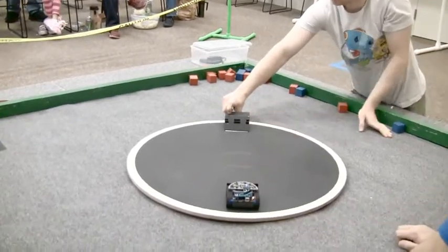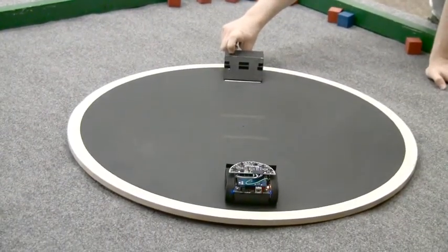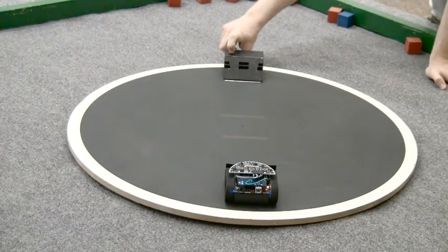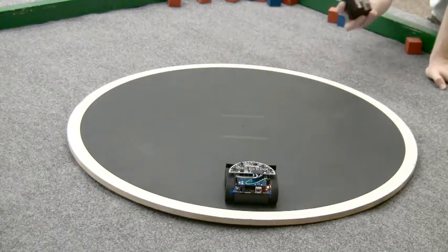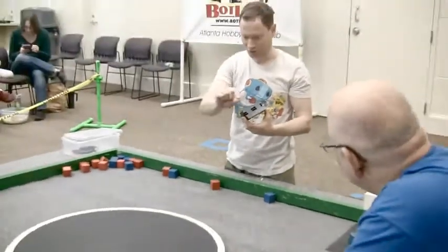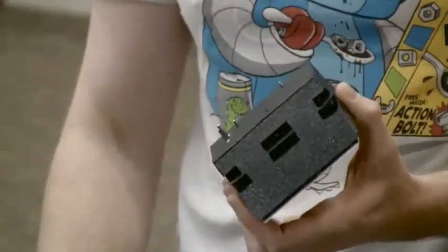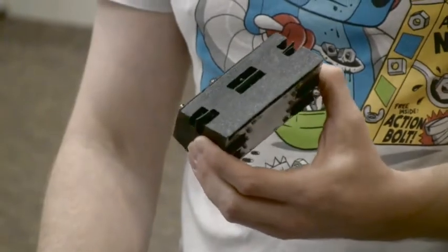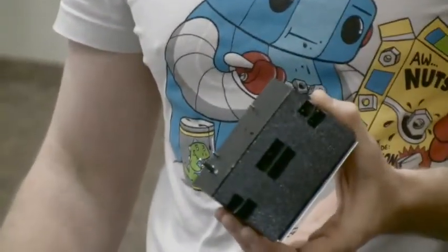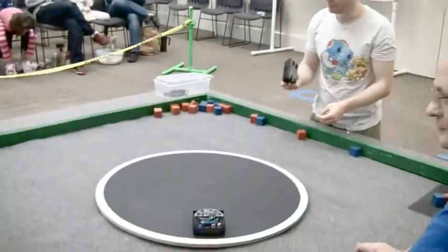And this one is scratch-built. Scratch-built? Yeah. So you built the boards and all that? Yeah. That's awesome. Is it 3D printed or CNC? The case — I just took an X-Acto knife and scored a sheet of plastic until I cut out the pieces, wiggled them free, drilled out the parts. Then I glued them together, or welded them together using acetone. Yeah. Cool. That's probably very strong.